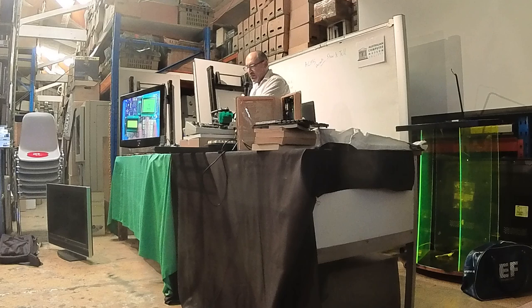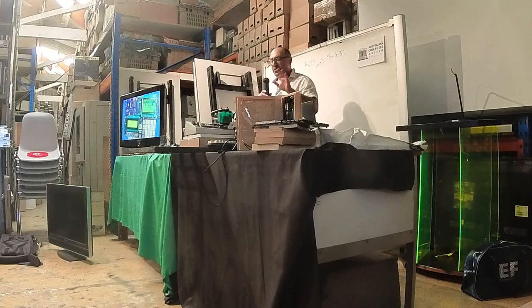Like this code here is quite large and complicated. I can move this, in fact, I'll do it now. You can't see on the screen. So smart block copy, I'll do 3000 to 3FFF. I know it fits in there. Go to 2000. So I'm going to move that 3D rotational stuff to another totally different new location. It's done it now. And if I go to address 2000, press go, it runs. So, full relocation of code.